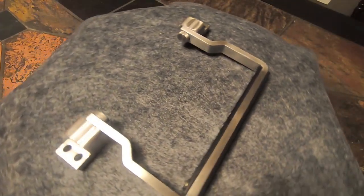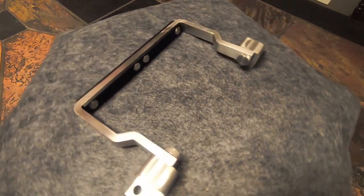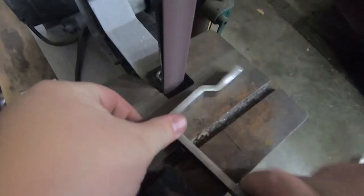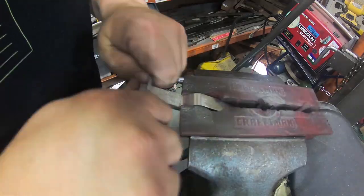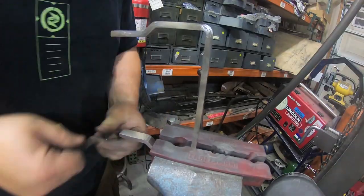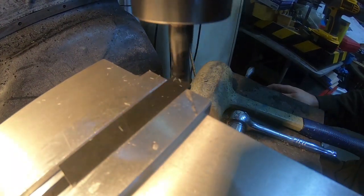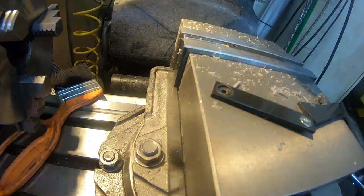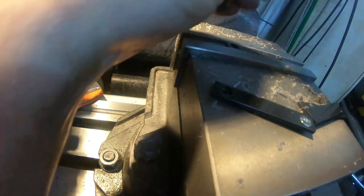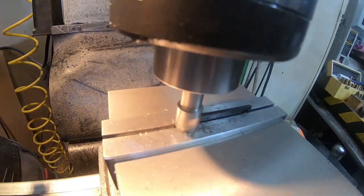The original handle was from a piece of test equipment, according to Sparks. I did some image searches for 1930s and 40s oscilloscopes and such, but I never found a match. Instead, I traced the outline and got it water jet cut out of stainless steel. With some sanding and filing, this ended up looking pretty slick. Stainless is a pain to work with, but I do love how it looks when you're done. The scales on the handle looked to be in two sections, so I replicated that as closely as possible. The Delrin plastic I used was an anachronism, but I didn't want to deal with Bakelite or whatever it actually would have been. Delrin also machines super easily, so it was pretty fun cutting a little radius on the edges and counterboring the holes for the screw posts I used to attach them.